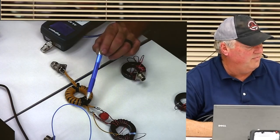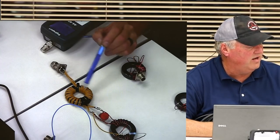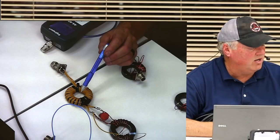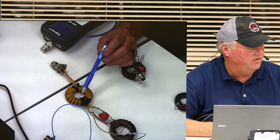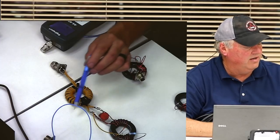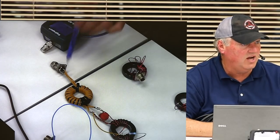And then with the dipole, you would hoist this up, and what this coil, this transformer or balun, does is it puts in what's called a high CMRR, common mode rejection ratio. What that means is there's enough reactance in here across the band that if my dipole, my antenna system, tries to put energy backwards down the coax, the feed line, it's going to stop it.